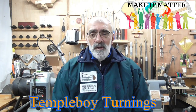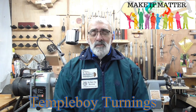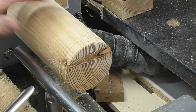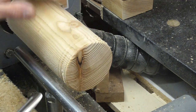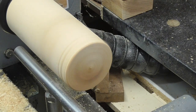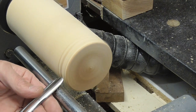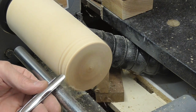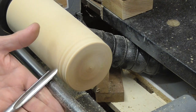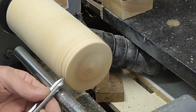So I'll change the camera angle now and we'll go through my methods of stopping your gouge from performing like an Olympic skater. Okay, so here we are with that lovely old fence post again — the one I did the cylinder video on. If we look at that again, if I'm approaching that without any bevel contact, it's going to skate back.